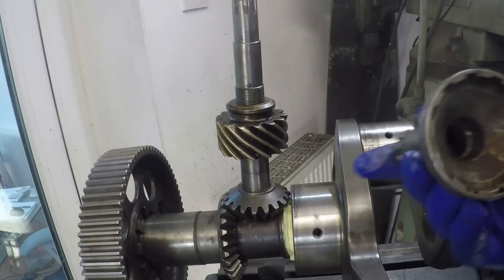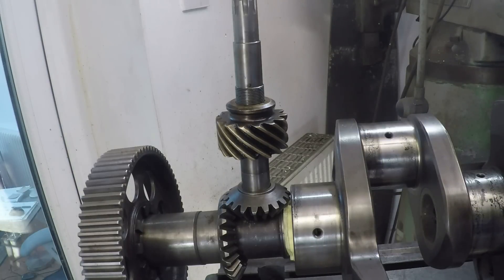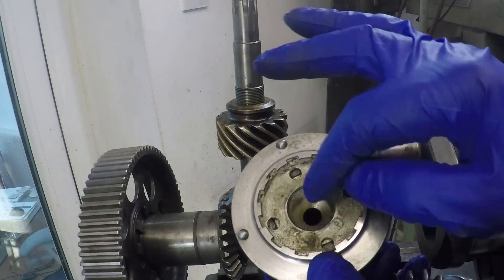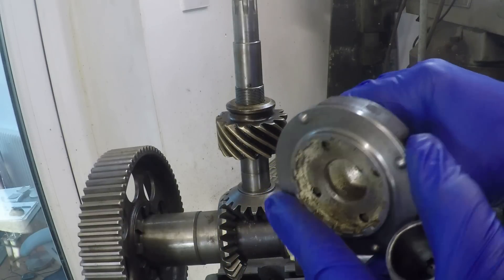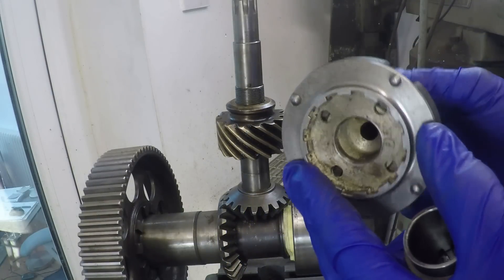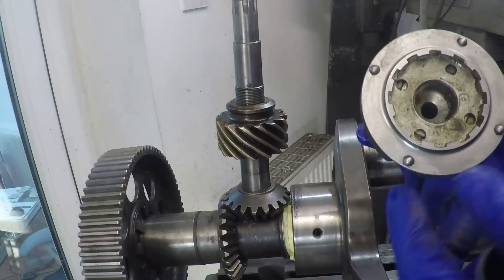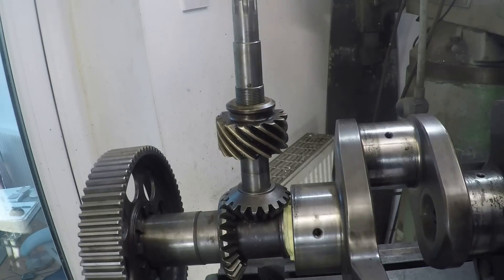The camshafts are also timed in the same way. They then went over from this solid metal coupler to one with a rubber component in it. Inside there's a spline which allows a very small amount of angular movement, so if the rubber component fails it still drives the magneto, but this basically allows some torsional movement. It was in 1942, when Alex Henshaw in particular started to get a lot of these failures, that the chairman of Rolls-Royce, Ernest Hives, was tasked with finding out more about it.